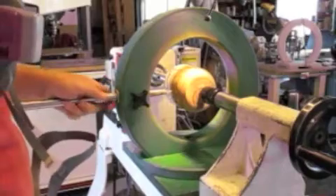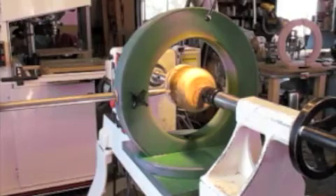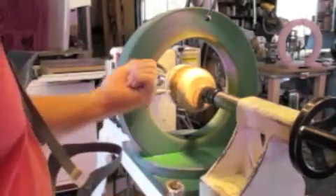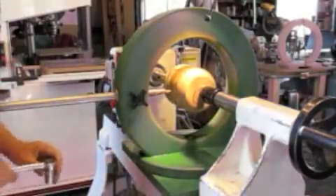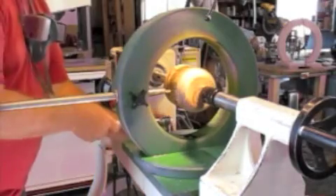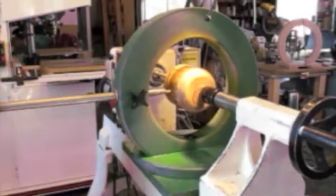Let me make sure everything is tight here. I need to readjust this — I lost about a quarter of an inch, so stand by. I readjusted it; I slid it further towards the headstock. There are two bolts that tighten the whole assembly, the whole plate down. I'll tighten those up and we should be good to go.